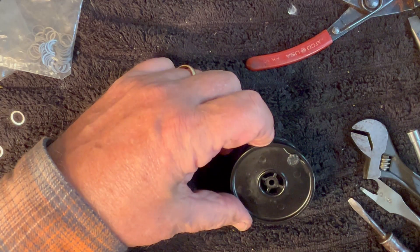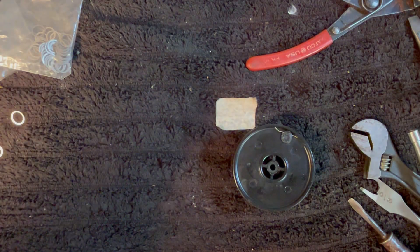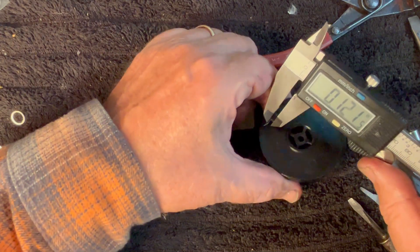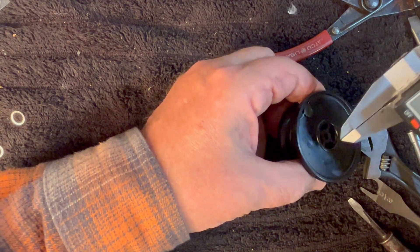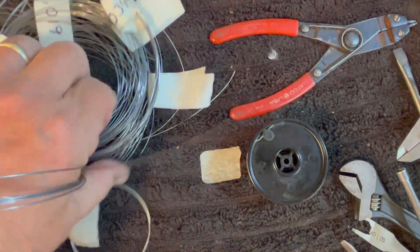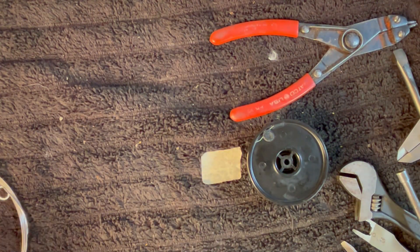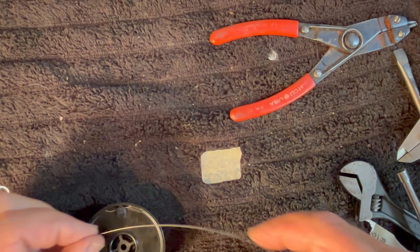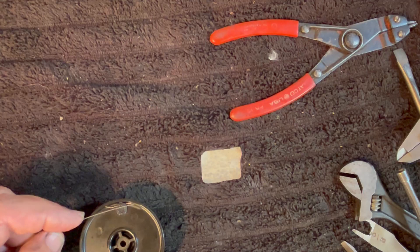All right, now that brings us to repairing this wire. What I'm going to do first is find out what diameter wire we're dealing with. Looks like it's going to be a 22. So let's see if I've got a 22 spring wire. The 21 is going to be the closest that I have to what was originally in there. So here's what I'm going to do — I'm going to create a new clicker spring. We're going to start it right there and then we are going to curve it up just slightly.